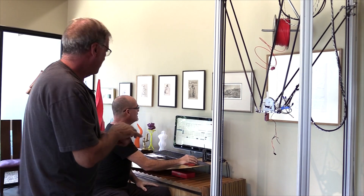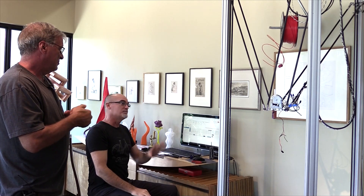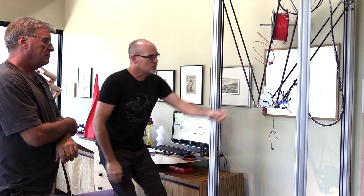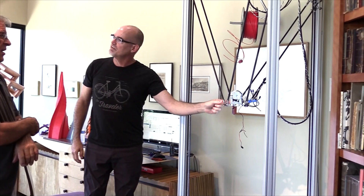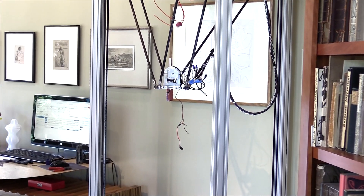I have just started the heater, so this is now heating up. Before we put any filament in, we're going to check the fan because we want the fan running before we get filament in there. We're just trying to cool these fins off — it doesn't melt at the top, it melts at the bottom.